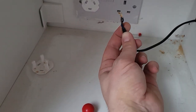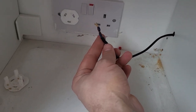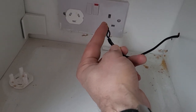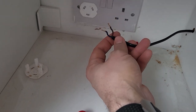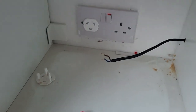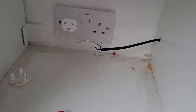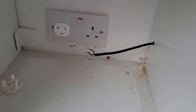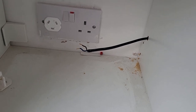Now all you're doing is giving yourself enough wire here to rewire the plug on the other side - and then you've done it. You've created a small little hole, not a massive one for the size of the plug, and then you can just rewire this. Like I said earlier, if you've got a moulded plug, you can get around that by chopping the wire and refitting it to a standard plug. I hope that's helped. Please do like and subscribe. If you're unhappy with any of this, please seek professional advice both in terms of drilling and in terms of fitting and rewiring a plug. Thanks for watching.